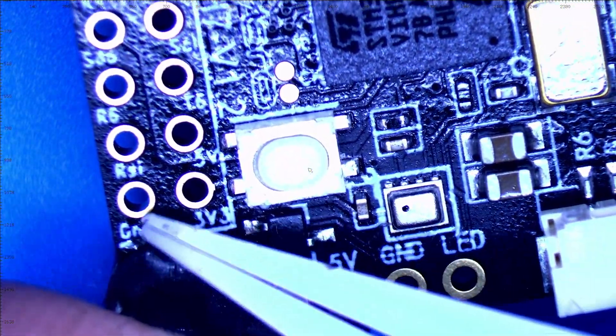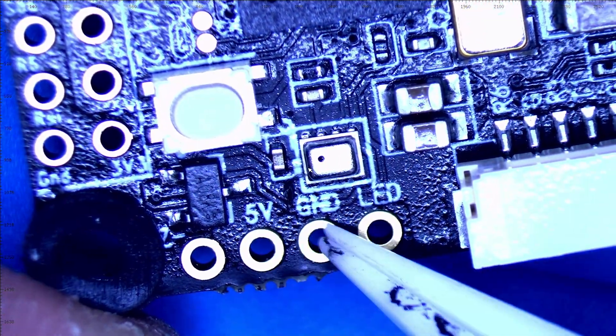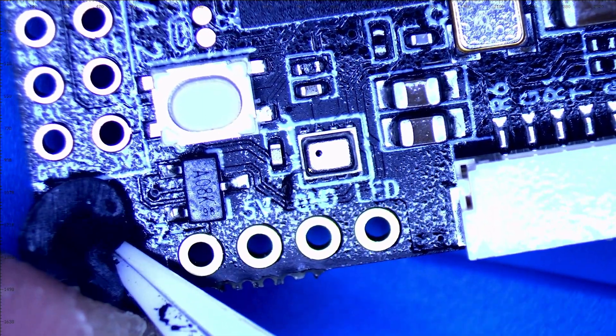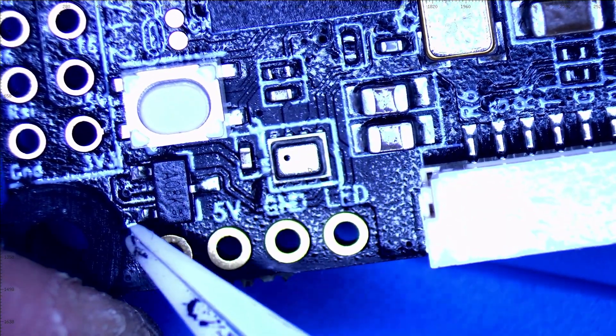We've got a ground and a 3.3 volt rail - the whole board operates off 3.3V, though as far as soldering things to a 3.3V pad, maybe Spektrum if anyone is still running that. There's a nice large boot button right there. In the bottom left corner you've got four pads: buzzer minus and 5 volts for a buzzer, or you can run 5V and ground to your LED strip with a signal wire for RGB control via Betaflight. I've got a full video on that linked in the description.